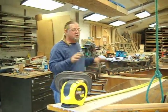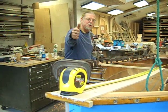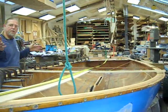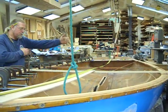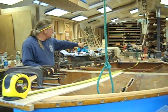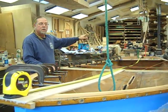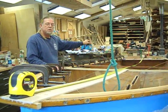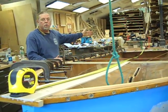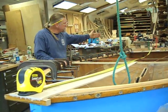Because we're a little concerned about this length issue, and this isn't a thistle right now, what we did is we took our jig, we measured back to the 5/6 point, and the length obviously changes as you squeeze the boat. If you squeeze it in really tight, it makes it longer. It should be noted that we took the transom out and refinished that, and we put the transom back in exactly where it was. But the stripping of the varnish and sanding it reduced it probably 1/16 inch overall thickness, half that being on the aft, half forward. So technically we made the boat shorter by 1/32 of an inch.